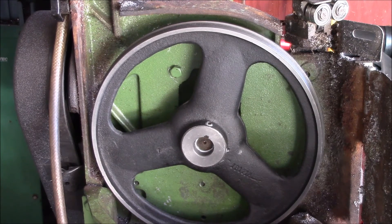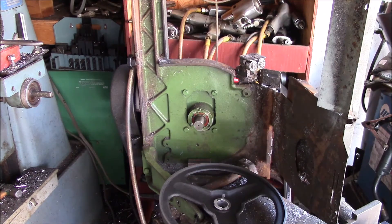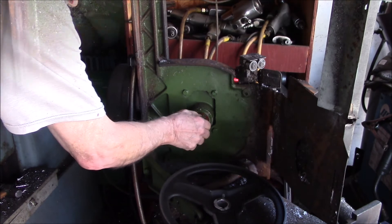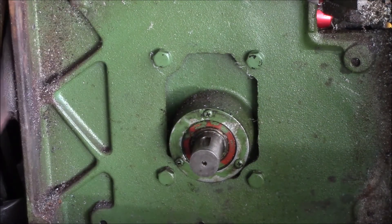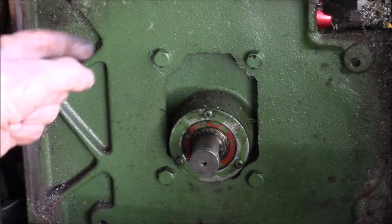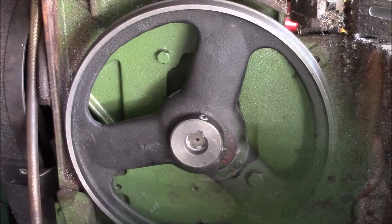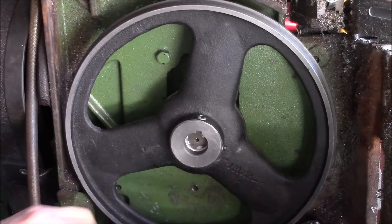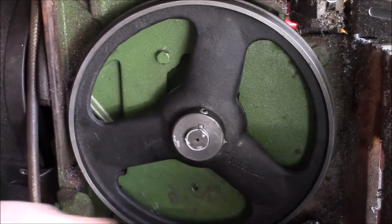I tried to polish the shaft up a bit. It's a little rough there — I think when the old wheel let go, the keyway must have pulled out of the slot and deformed it a little bit. The key would have pulled out in that direction and you can see the damage right on that side. After a few minutes of filing, that did the trick — now I can rock the wheel on and off, and it just taps on nice and easy.